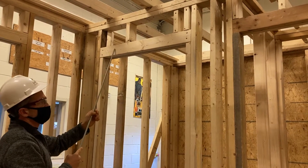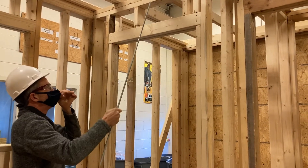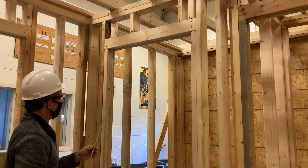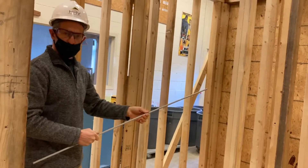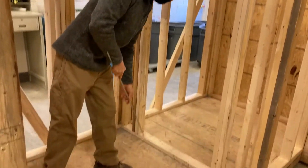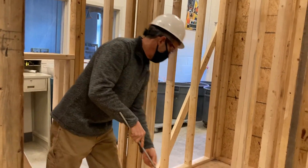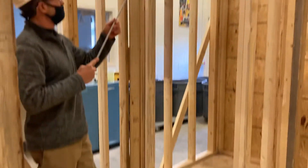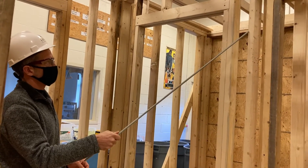They put the cripples. This is the header — this would be a built-up header, not a flat header, because it would be bearing weight. It's bearing the weight, so we make sure we have a pretty strong header for our door. Our door was a two-foot, four-inch door, so we made our opening two feet, six and a half inches — we added two and a half inches to the door to make our rough opening. They'll have to cut the bottom plate out there tomorrow and finish the door opening. The guys finished that and it looks good — they got their header, their cripple, their jacks, their trimmers, and a common stud.